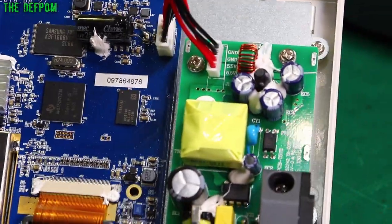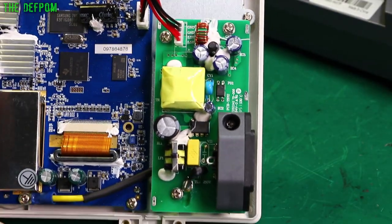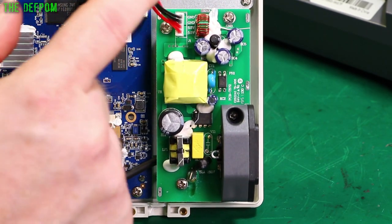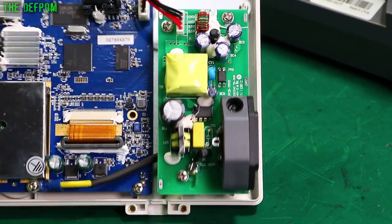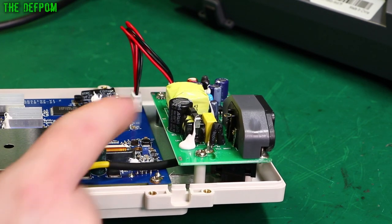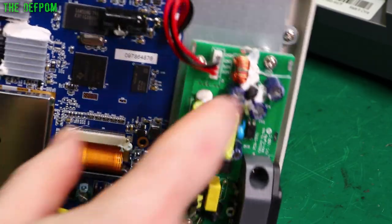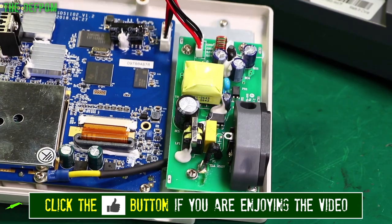Let's start with the power supply — it's a nice little bolt-in power supply module. There's a 5.5-volt rail with dual wires coming through, so that's the 5-volt supply. Really simple. The brand — is it Ace-She? I've seen those in other things as well, actually seen them in Siglents. So it's obviously an off-the-shelf kind of module and they've probably just put it in there.